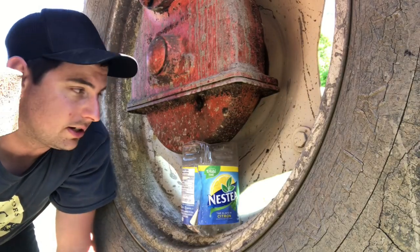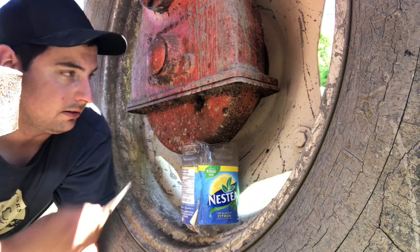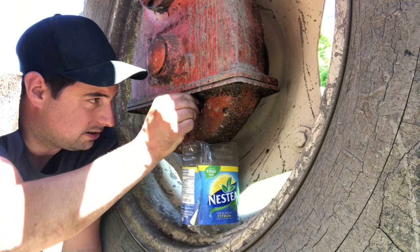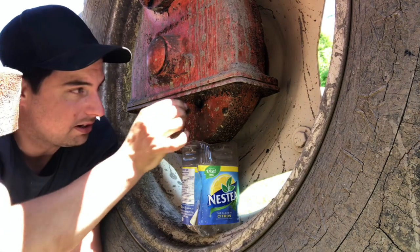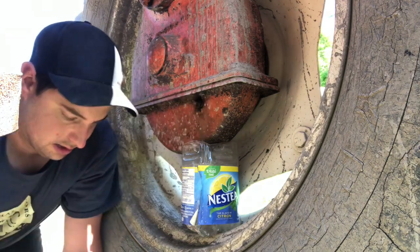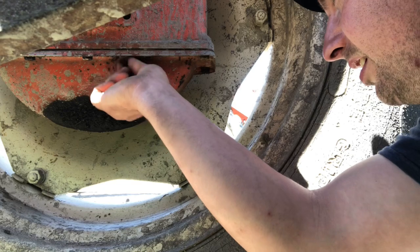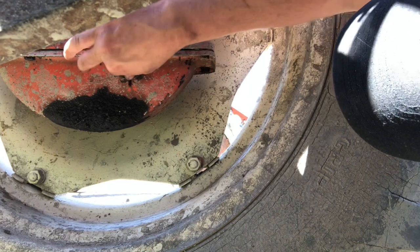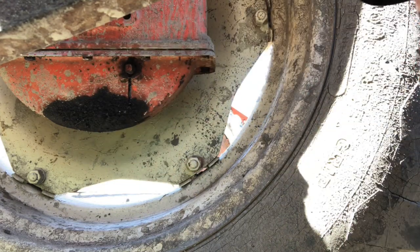The last thing we're going to do is check the oil in the final drives, which is right here. There's a half-inch plug on either side. We'll get that out and see if there's anything in it — if we need to top it up, I have everything here to do it. That one's on my finger, so no top-up needed on this side. We'll go to the other side, and it's starting to drip out, so all the fluid levels in this are good. But the transmission is not great, so we'll change that now that we know that.